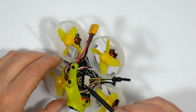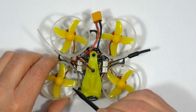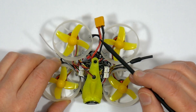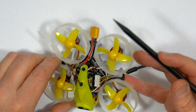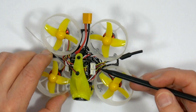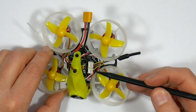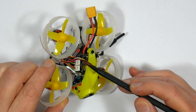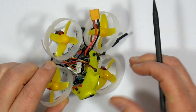The FSD408 16x16 flight stack is neatly mounted in the usual diamond arrangement, and you can power this with 2S or 3S using the XT60 connector. The stack includes the 4-in-1 BL-Heli ESCs that deliver 8 amps continuous — burst current isn't actually specified. The USB connector is nicely placed on the top and is very easy to get to, which makes a change.